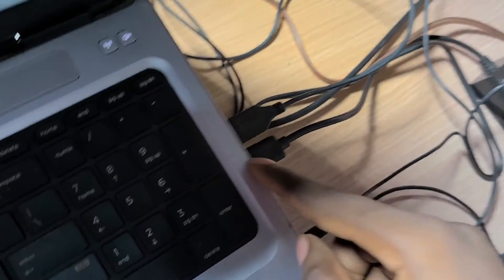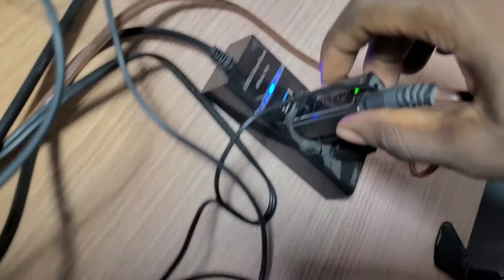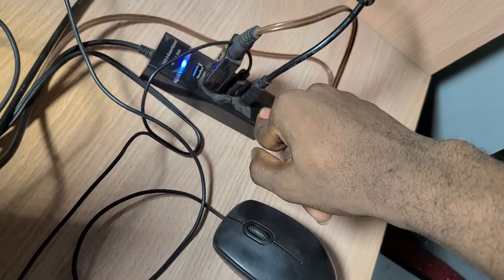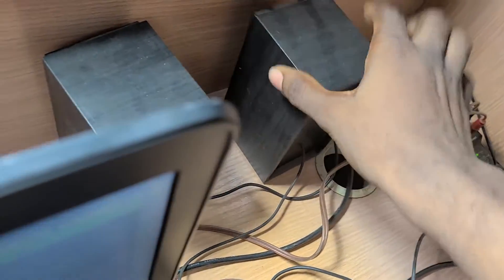My system doesn't have a lot of USB ports — only two. So when I need more I use a four-in-one USB hub. I connected my output source directly to this sound card, and from the sound card I connected to the USB. It also has an additional output port here, so you can connect that to USB as well. I also have an external speaker connected so I can hear my audio clearly.